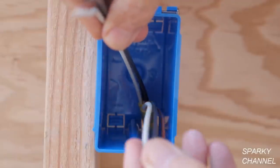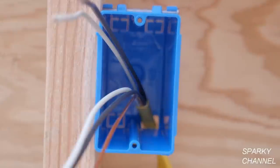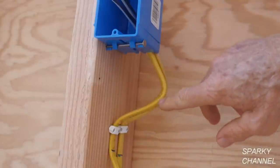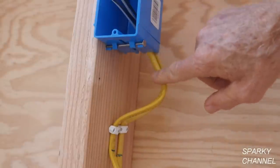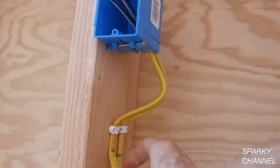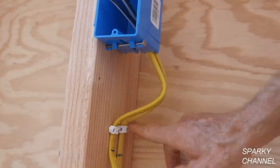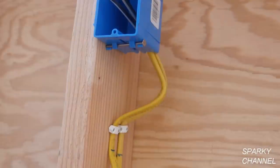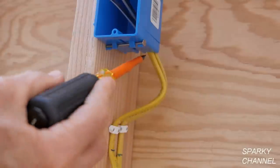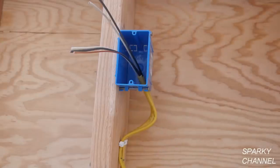They're loose, they're not connected. It's a 4x2 box. Underneath the box I've made marks at 8 inches — this is 8 inches of sheathing run right here, so there's a mark there and a mark there. I have my staples at about 7 inches, with a little loop here. So the cables are stapled at about 7 inches of the length of the sheathing.